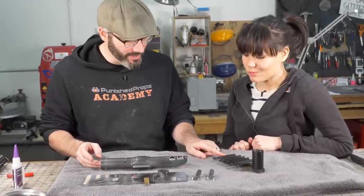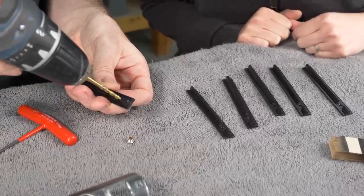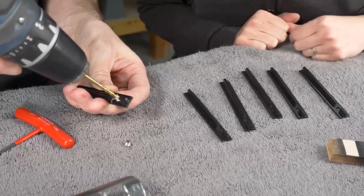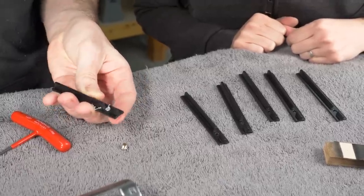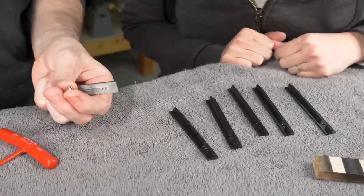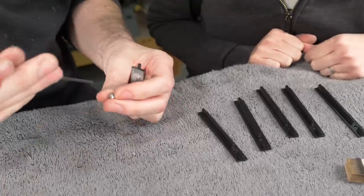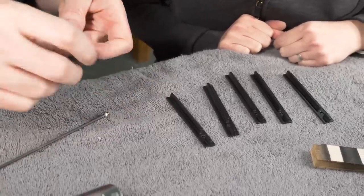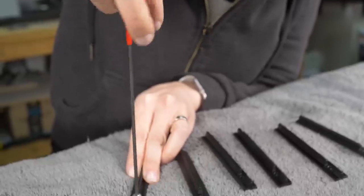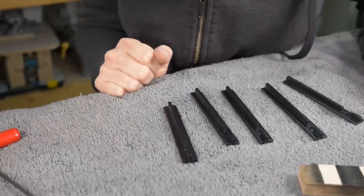And I think we should start with these handle fins. I designed some holes there, but they're not big enough for the screws I want to install. So make that a little bigger, carefully. And then the screws I have, these are just stainless M4s. They sure look the part, don't they? It's pretty close. So these can just get driven right in there, and you don't even need to really tap it. You could, but you can just drive those right through all of those. Pretty damn good. That looks awesome. That little bit of metal just sells it.